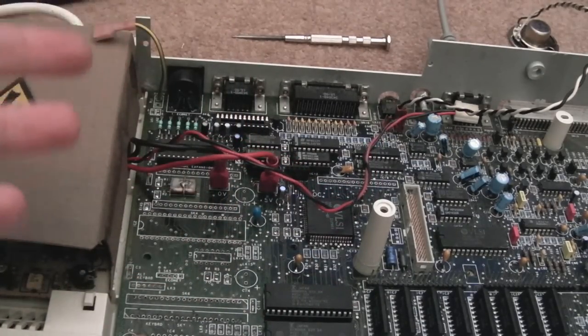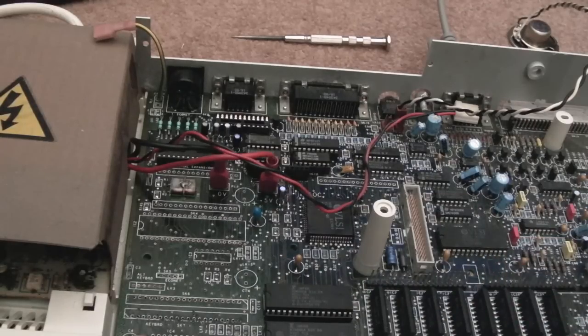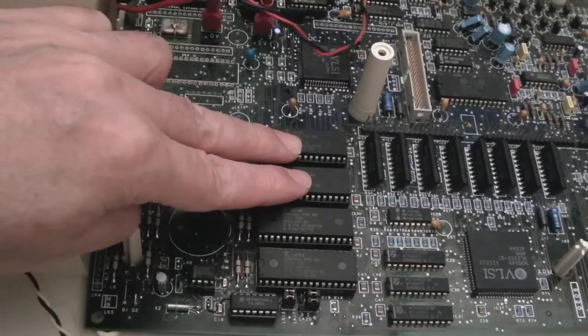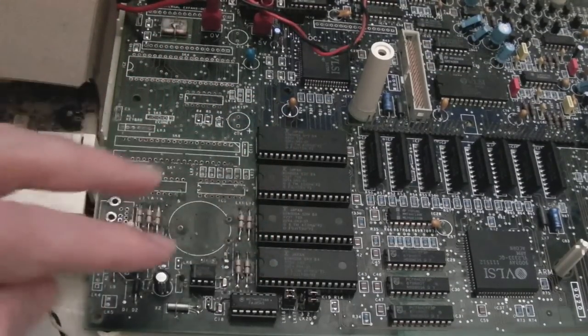I figured that it should at least boot, but I was getting nothing. Now I went round all the pins with the logic probe and I could see activity, and activity tied into the reset, which gave me some confidence it was booting, but there was just nothing on the display. It wasn't initialising the display at all, not even a flicker on the TV. So that's why I tore down one of the working ones and borrowed the ROMs,